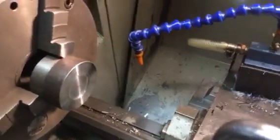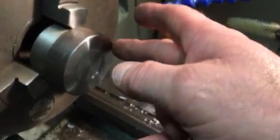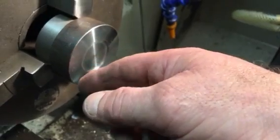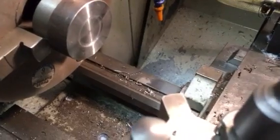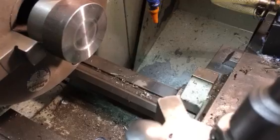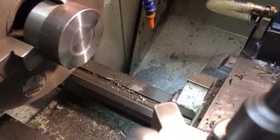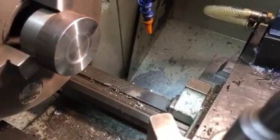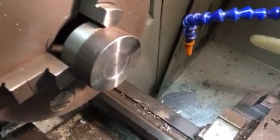The actual one in the headstock here has already been machined. I've turned it down and relieved the middle so that when you're clamping you're holding on the outside, because normally a lathe would always cut a convex cut due to the cutting speed. Because I haven't got variable cutting speed, the tool at the end tends to push away as it's not going fast enough in the middle. So I always relieve the middle of the pressure pads.